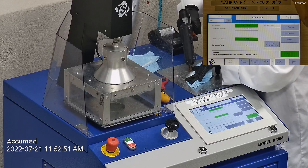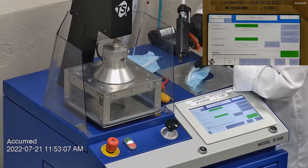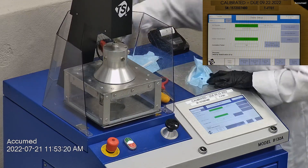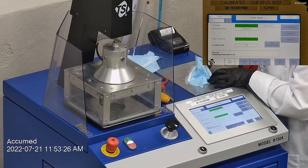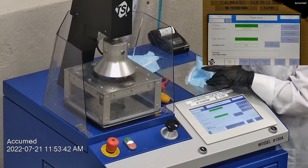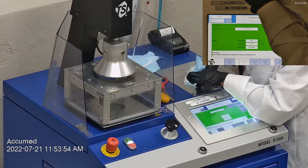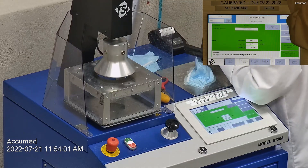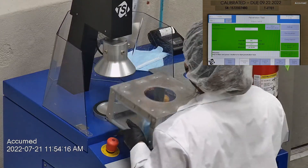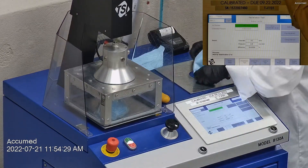When applying the hot melt glue we make sure there are no holes or leakage around the seal to ensure accurate results. The testing plate is attached to the frame and the box is placed under the TSI filter holder for testing. The results are displayed on the TSI monitor. F stands for airflow rate, which we test at 85 liters per minute. R is for resistance, also referred to as pressure drop — this correlates with breathability, so the lower the number the more comfortable and breathable the mask is. E stands for filtration efficiency percentage.